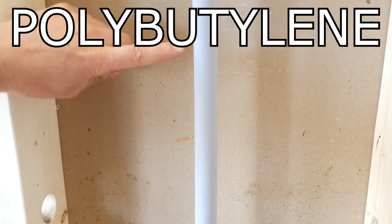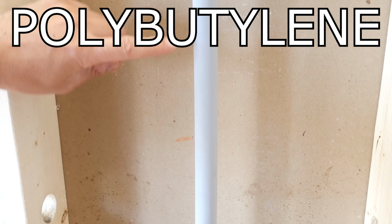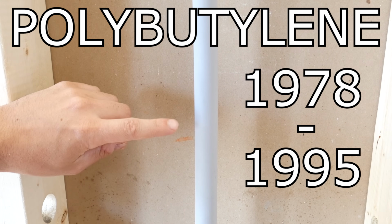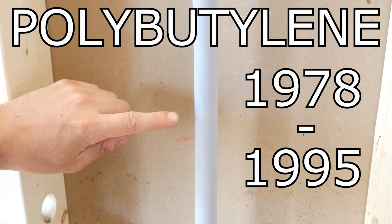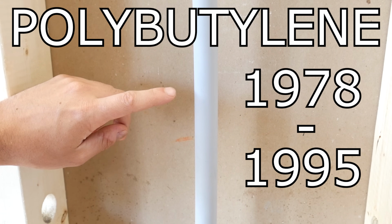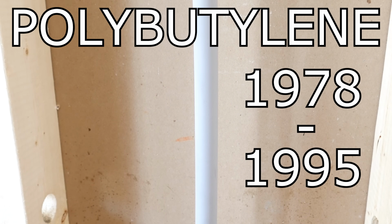Now, what if you have polybutylene piping? Poly-B was used in more than 6 million homes between 1978 and 1995, which was this gray pipe right here. And it was discontinued due to it becoming very brittle and leaking. So a lot of people had to either transition from it or completely remove it.